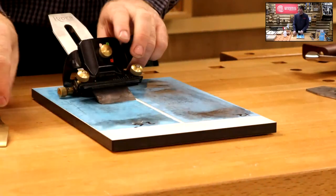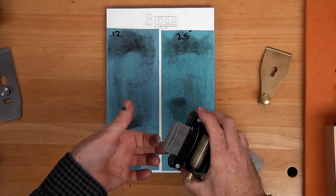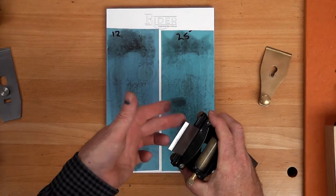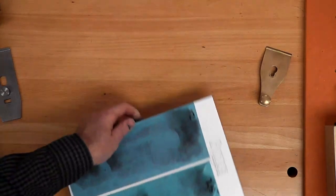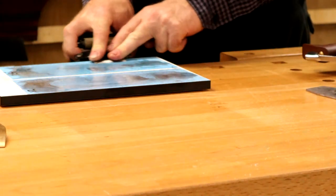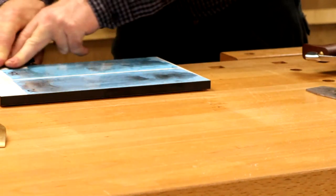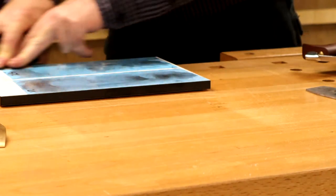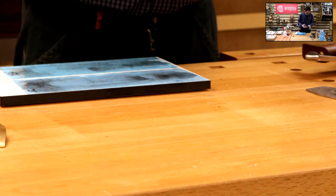You can see what we're taking off as a residue at the top here. You can see the dark colour. Fingertip now playing with, am I getting a burr on the back? That feels pretty good. I'm going to go down to here, Ben, probably two. I've just got it level with the bench at the moment, so I can do the back edge. Just enough clearance on there with that honing guide coming to there. So we sharpened our five.